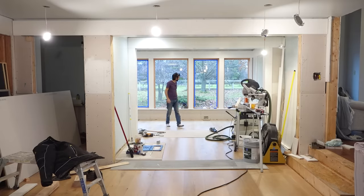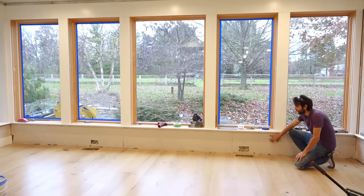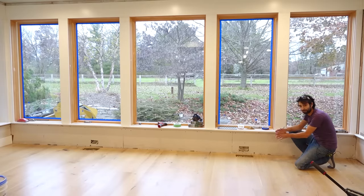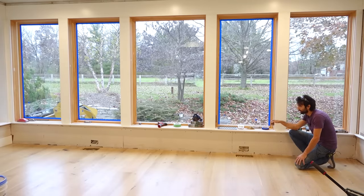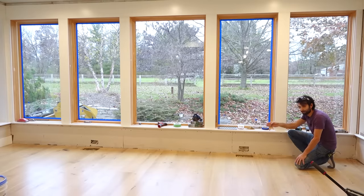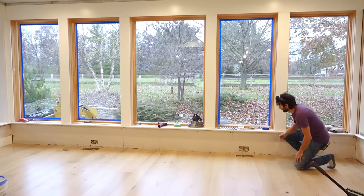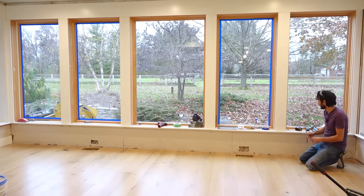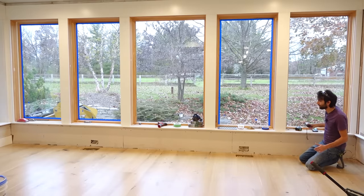So I have to figure out dimensions for things. The V-groove paneling, which is going to go on here, is going to be 5/8 of an inch thick. That will give me a step between my baseboard and the paneling, just to give it a little bit of a reveal there. And I want to divide out the space so that I have an even division. I don't want a skinny rip at the end as a remainder. So the plans spec it as a 6-inch V-groove paneling, and I'll make it a little bit different as needed to make this all work out nicely.